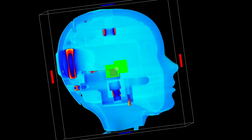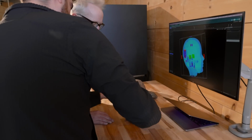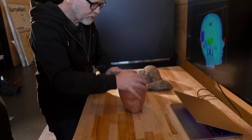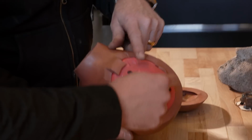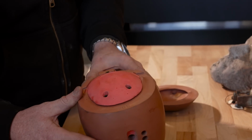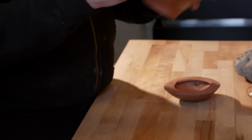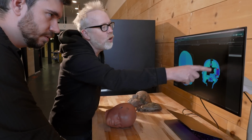Yeah. And then, I think of this as really the business end of any crash test dummy. This is where the sensor goes. Okay. So back here, you can take this plate off. There's these 3 screws here, and then you're able to seat some kind of sensor. Pop that off. There we go. Right. So the sensor goes in there. So you take these screws out, and then you'd be able to put a sensor on the inside, and that would sense the force that the crash test dummy sees, whatever hellish life it's about to have. Yeah. Right, exactly. And look, that's all hollow.